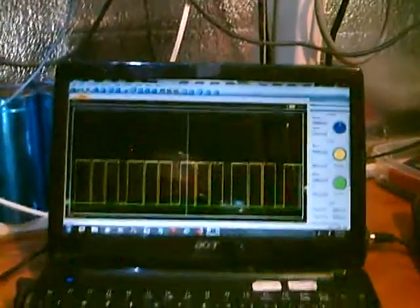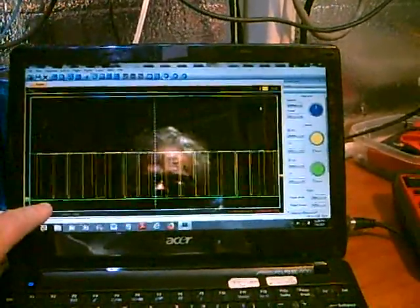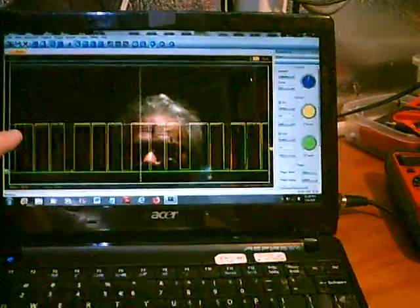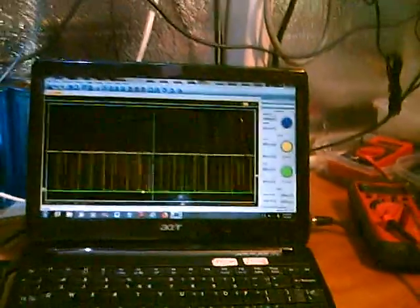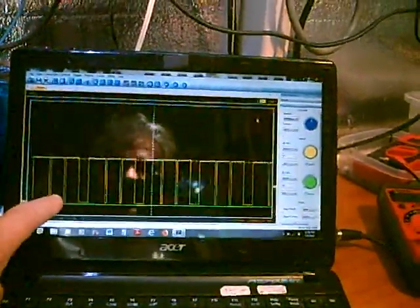This is our output — we're just clocking right along here. This lower level is when the heater is on, and that's zero volts. We're looking at the voltage across the switched FET. Up here is your PV bus voltage, so that's 60 volts. When the signal is down, the heater is being powered. There are narrow and wide pulses, showing that it is actually controlling.